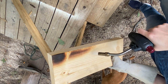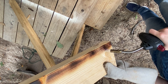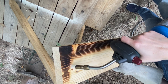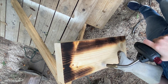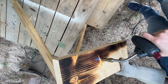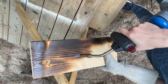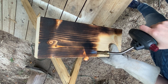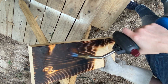So what are we doing here? My favorite finish — the Japanese finishing technique, shou sugi ban. Part of the reason it makes sense for this piece is because if there is any watering, the char will protect the wood, whereas a stain would create a ring. And if you want to refinish it, you just burn it again.